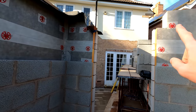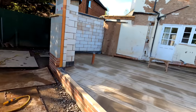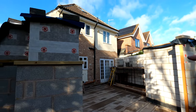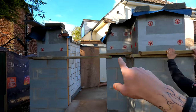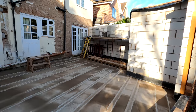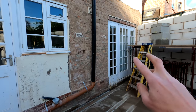We're just going to leave these two blocks out so we can get all that sorted out afterwards — just enables him to carry on with all this block work. We've got a lintel to go in across here as well — obviously this is going to be a window so we need a lintel across the top of that to carry the block work. And he will continue across here. There's no lintel to go in this opening because obviously we've got our steels coming up, so our steels will just sit on our padstones. Lintel to go in across here across this window as well, and then another tile crease detail to match in.